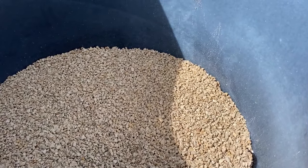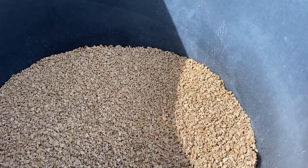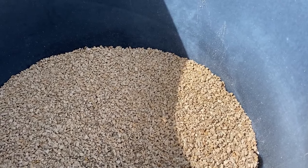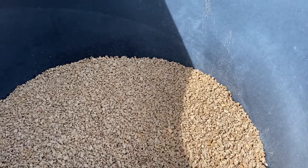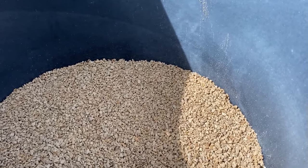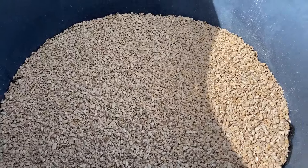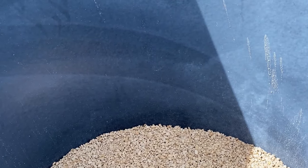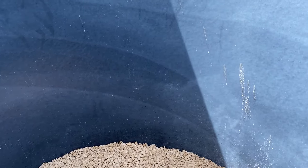So the layer order is: coarse stone, medium stone, medium stone, medium stone, fine stone, fly screen, charcoal, fly screen, fine stone — and then from here we fill it with sand. I wish I would have got a bigger tank because we're not going to have a lot of sand in here, about a foot and a half. Hopefully that's enough.